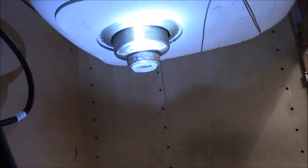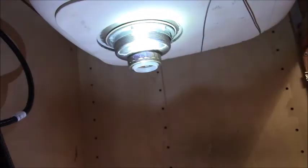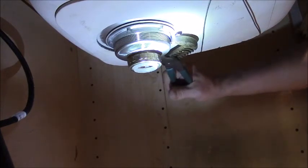Now that's our tie-in for our drain, of course. The sink is so deep that it's very difficult to hold this guy and get this guy to stop. And the trick in most of these threads is you back up until you kind of feel it click. And there we go. And the paper just adds, I don't know, some compression. Now, as I was saying, you can grab between these lugs, a big lug, like that. And cinch them down.